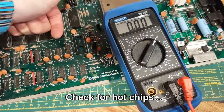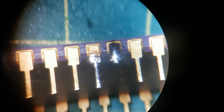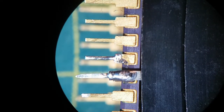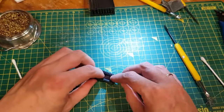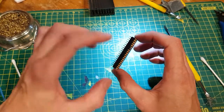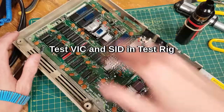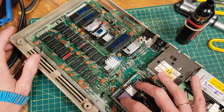Let's just see if anything's getting hot. I'm going to try and repair the VIC-II chip now — I'm going to nick one of these legs, cut it down and try and solder it on. That's the broken side. You can see on the pin to the left of it that it is corroded. I've tinned up the top part of the leg, and now I'm going to graft on a cut-down socket leg. There's the finished job. It's not the prettiest thing in the world, but she should hold. I use that socket to be a carrier board, so the stress is on the socket and not the VIC-II. So now when I take it in and out, I'm taking it in and out of the socket and not the chip itself.